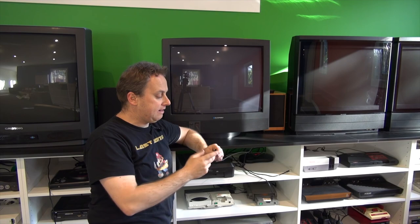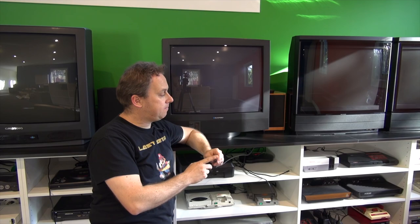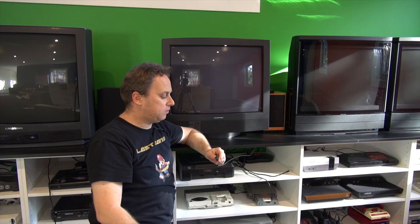I've finished the 8-pin DIN plug on the Neo Geo end. That's all done, and I haven't tested it yet, but I'm sure it's going to work. I know these pins like the back of my hand because it's the same pinout as the Mega Drive and the Master System — a couple of systems share it, and some other applications too.